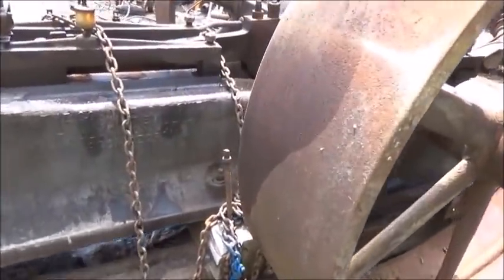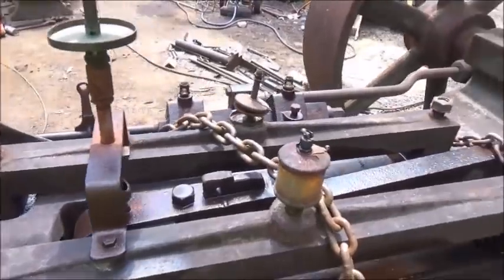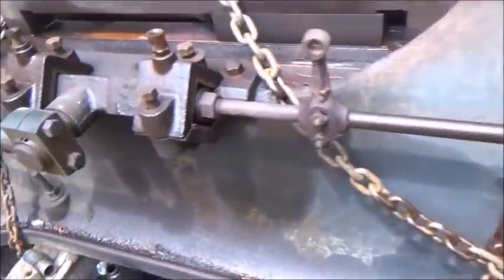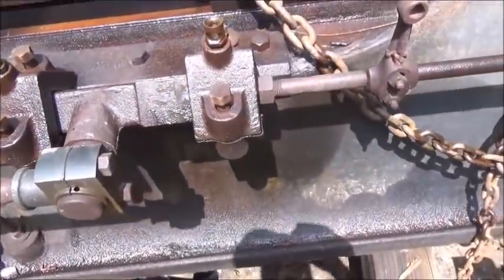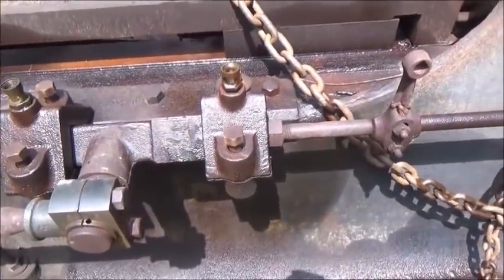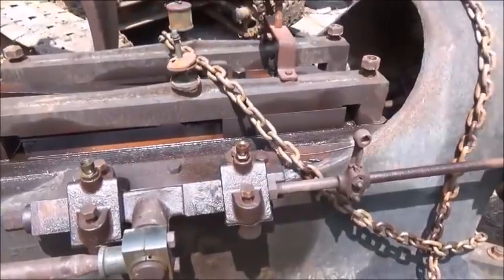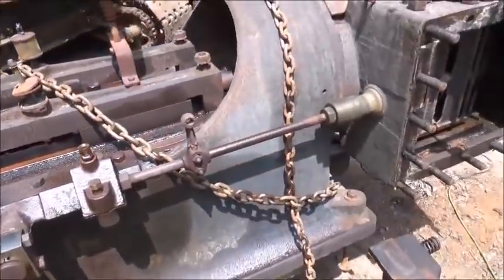All right, folks, I came in here and I loosened up everything. I loosened the bearing caps up, I loosened up these guides, the valve train on the other side. See, the piston's up at the top now. Loosened these up and oiled everything really well. And of course we hooked this bar on it and picked up. It's rolling over. Still tight, of course,